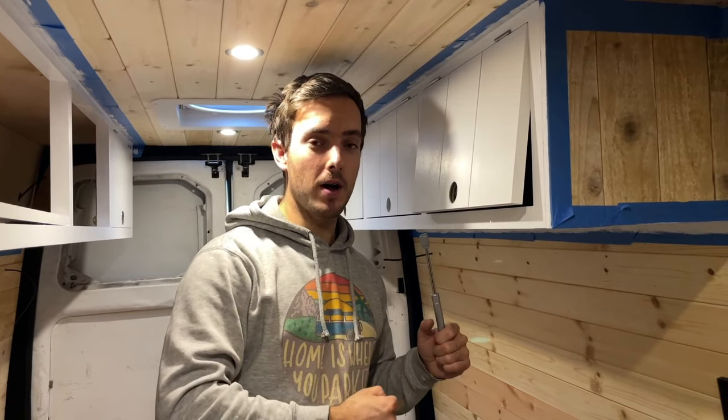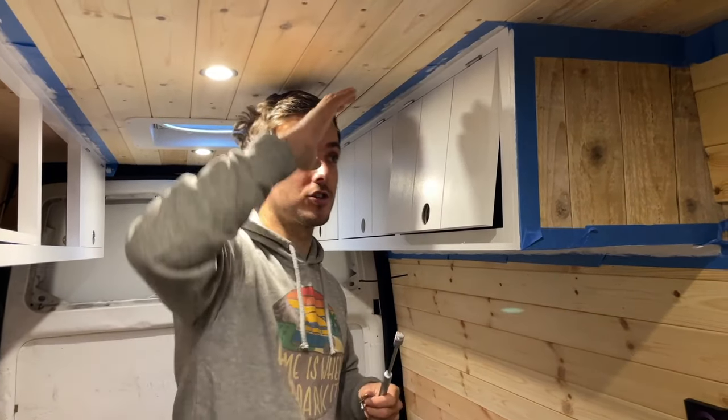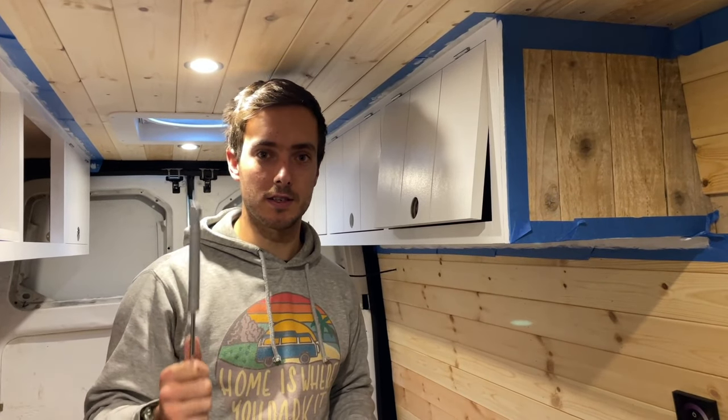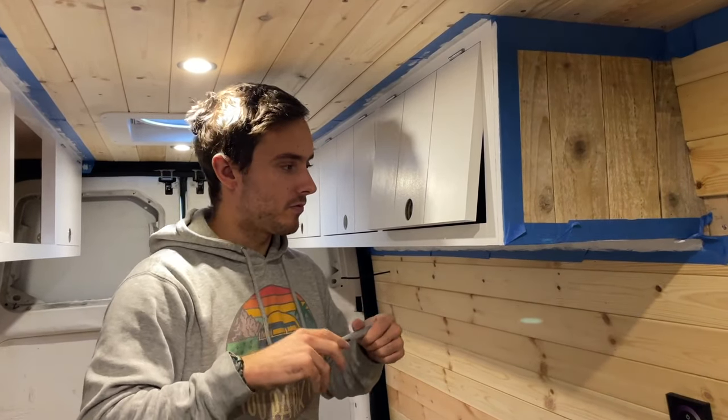In the past, for these size doors, I bought 150N, not realising the difference. So I've got pistons that will open a 15 kilogram door — it might be a bit sharp and abrupt when you're opening your cupboard, it might smack you in the face, and you might also struggle to actually push it down. So you want to make sure that these are correctly weighted to your door sizes. 30N to 40N for most kitchen cabinet doors will be fine.